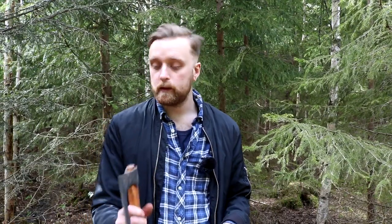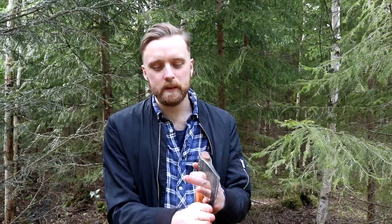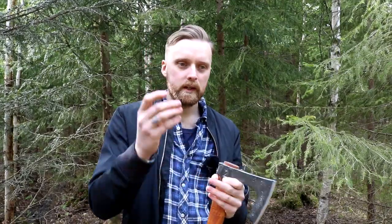And it's made just like I usually make the Viking axes. I fold the eye basically and also forge weld the beard on. And the beard itself is forge welded like a taco bread. So mild steel, taco, I was going to say taco, but mild steel, then high carbon steel, then forge out the blade, then weld on the blade to the body. I really like that process.